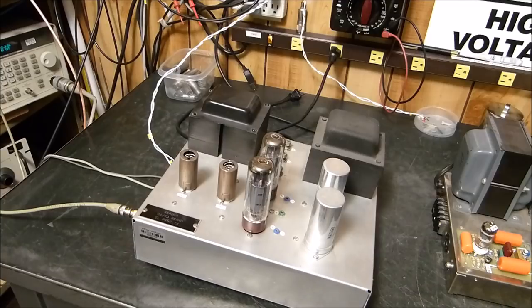It boils down to, you can do all of the tedious work you want on determining what the output transformer impedance should be, but in the end, you're basically going to select between what's made. And what's made are values like 2K, 4K, 5K. 5K is the most popular in the world. 6.6K and an 8K. I mean, you can get other values. We know that. But you're probably going to be using a 5 or a 6.6K, odds are. And that's what you're stuck with.